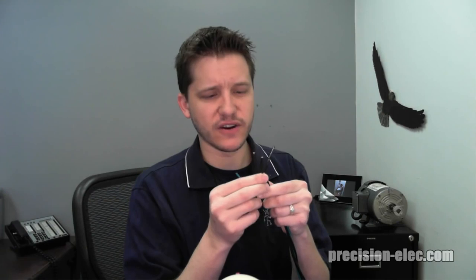You have three motor wires, typically, and that would be U, V, and W. In my case, they are not labeled. In many cases, they don't have to be phased in a certain way — they can be wired with any of those three wires U, V, and W. Depending on how you wire them and how your motor is wired, that can affect direction.